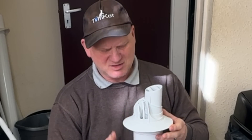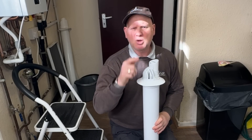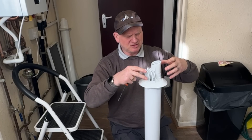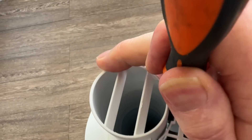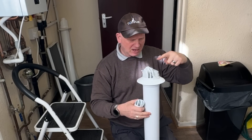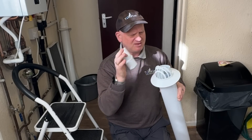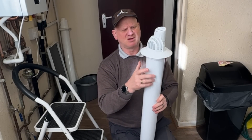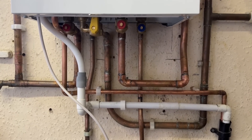I used to love the rubber ones — why do we go to this rubbishy plastic? That's where it's supposed to fit and it is a bit of a struggle. One thing I do like is when you come to put a flue management kit on this: where you used to have to change the full terminal, you don't now — just slide a flat screwdriver into that slot, this section comes out, and you can put your elbow on there for a 45-degree diversion. Dead easy to clip back in.